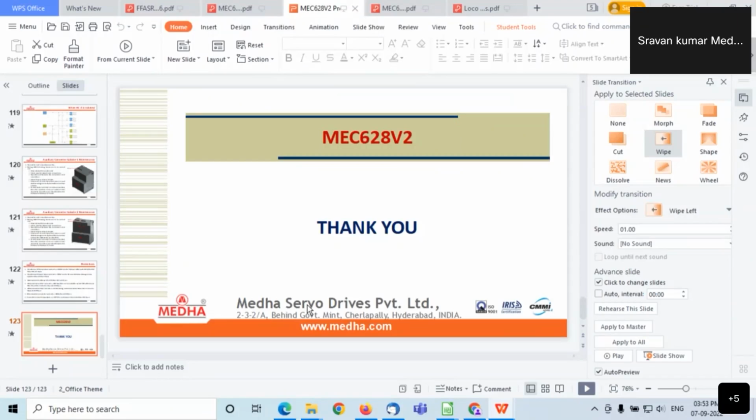I think the transformer oil temperature sensor is only one. If that is defective, the complete traction converter will be isolated if the temperature limit is crossed because of the defective sensor. The transformer is for both converters, yes, sir, so the system will open the VCB directly. Okay, fine.